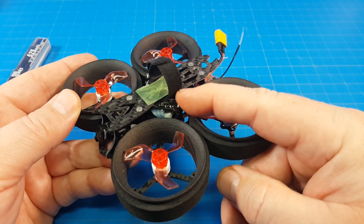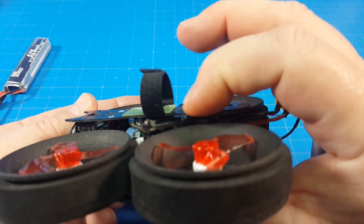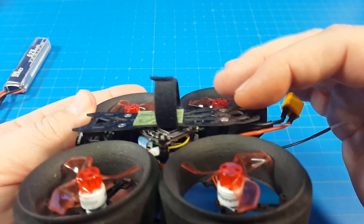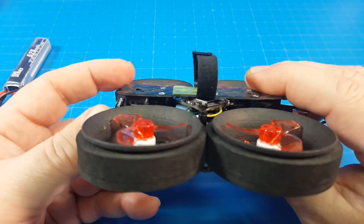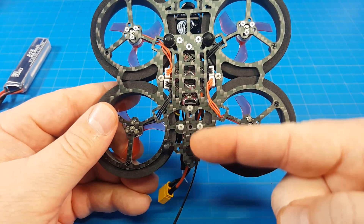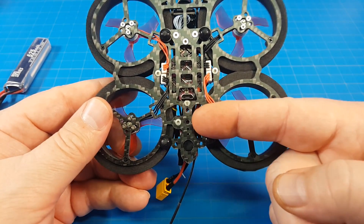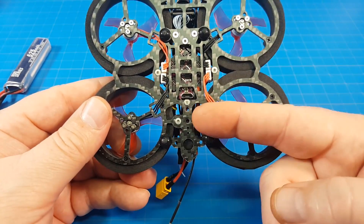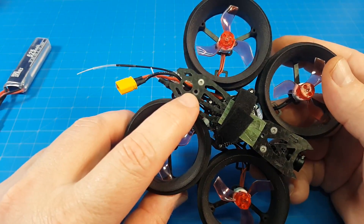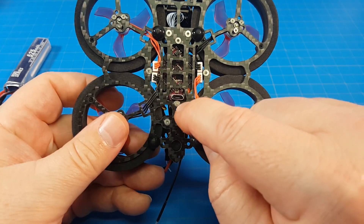While I was in the stack, I lowered it down a touch by pulling the standoffs out. I didn't want it pressing down on the SD card area and I wanted the battery strap roughly in the middle so I could get the battery as far forward as possible while still having space to mount the Insta360 GO. On the bottom of the frame, there are some recessed holes — it kind of feels like this frame went through a couple of iterations. Models coming off the mill may not have these holes.